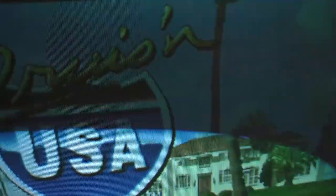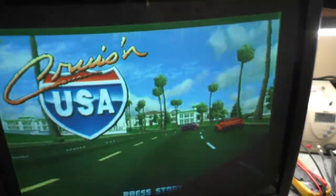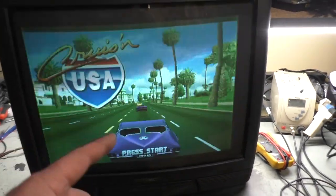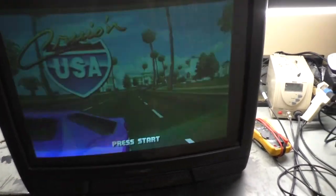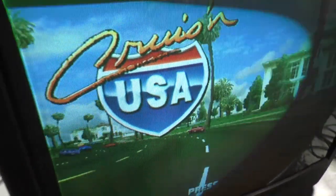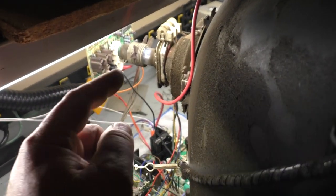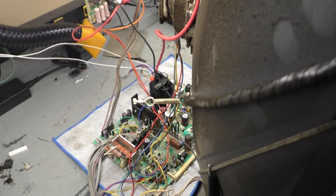It looks beautiful. Colors are all wrong and brightness and stuff. I'm not going to white balance this because it's not staying on this tube, like I always say. But it does operate and works in medium res. And it does operate and works in standard res. I just think the sizing of this and whatnot needs to be left alone to its dedicated U5000 27-inch yoke.